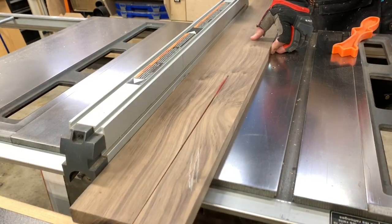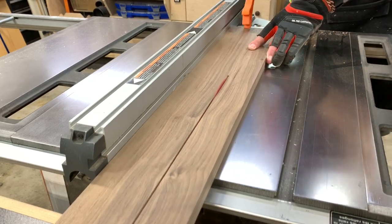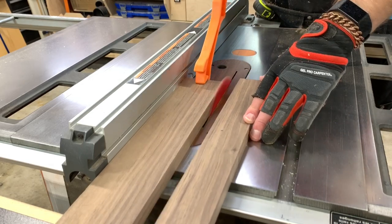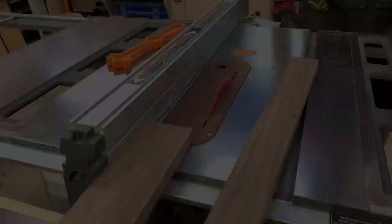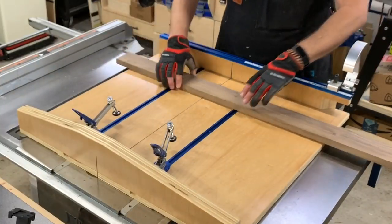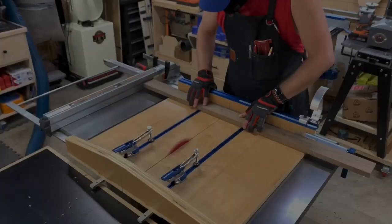The next area that I needed to tackle was mounting the base to the bottom of the tabletop. I did not take into account that I was leaving the center of the bottom of the table empty, and therefore I would need to build up 3/4 inch to get the table to sit at the 30 inch dining table height. So I decided to make this upper mounting section out of some spare walnut that I had left over.